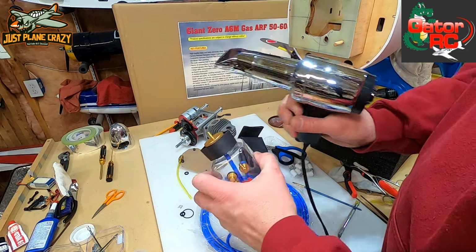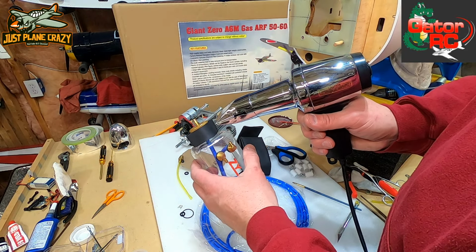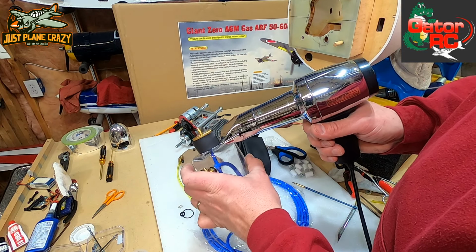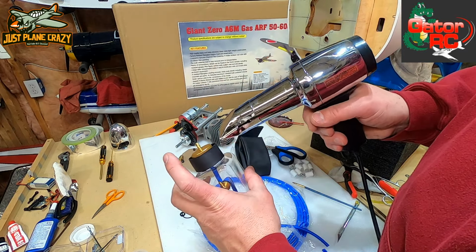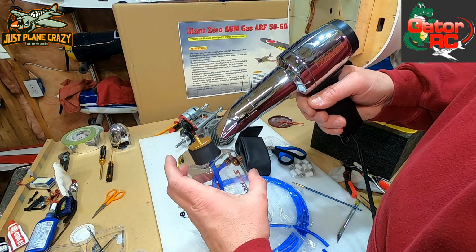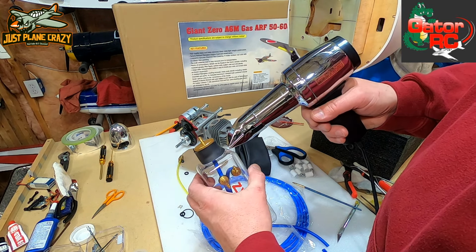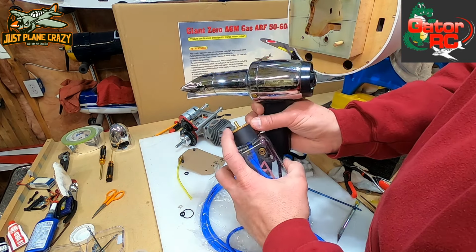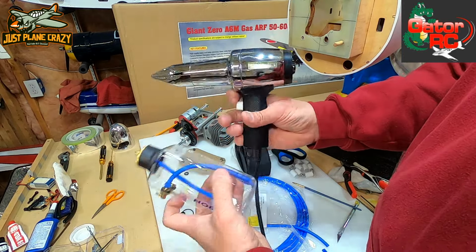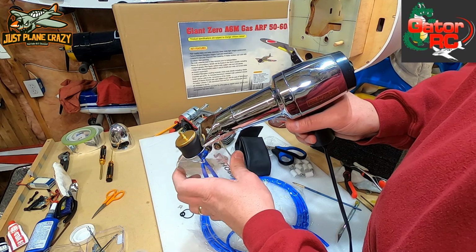Now this is going to do two things for us. Number one, it's going to make sure that lid never comes loose, but also it's going to make sure that it's sealed, so it never is going to leak around that O-ring. And as this is shrinking down, I push it down so it stays on the lip of the tank. Then we'll seal it up towards the top.